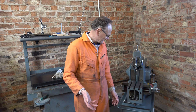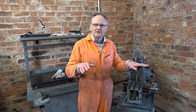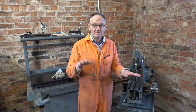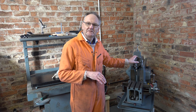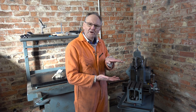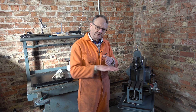Just thinking about it — what are the components of a surface grinder? Well, you need a table and the table's got to go up and down, a bit like this one. Then you need a way of the work going backwards and forwards underneath the grinding wheel, or alternatively you could have the grinding wheel going backwards and forwards over fixed work. If there was something fixed to this ram, it would be a bit like that. And then you'd have to have some way of bringing the work and grinding wheel closer together, and some way of the grinding wheel or table moving across.